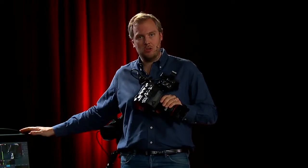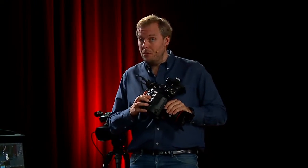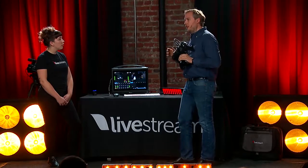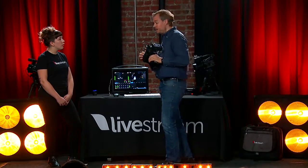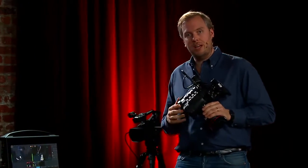The Studio HD 550 supports both HDMI and SDI. When it comes to HDMI, it's very simple: you can have affordable cameras or slightly more expensive ones, but you're limited in cable length to about 10 meters or 30 feet. The advantage is it's a single cable and you just plug it into one of the five inputs.